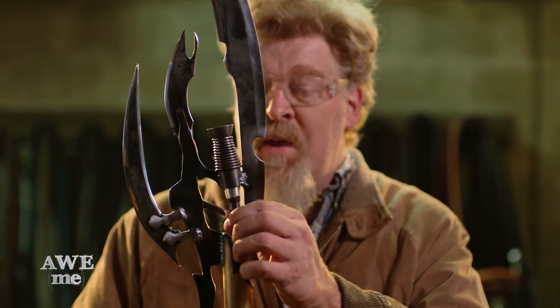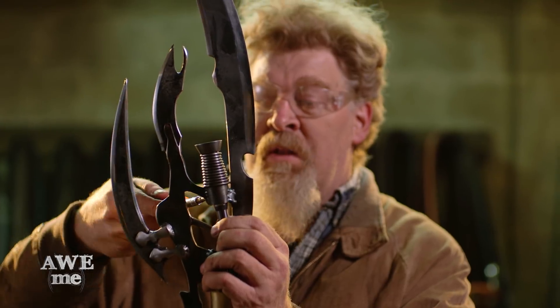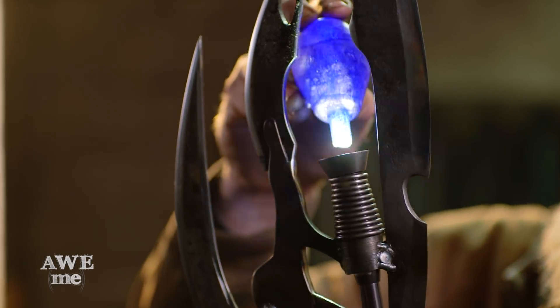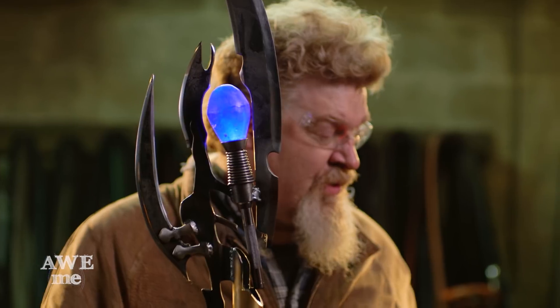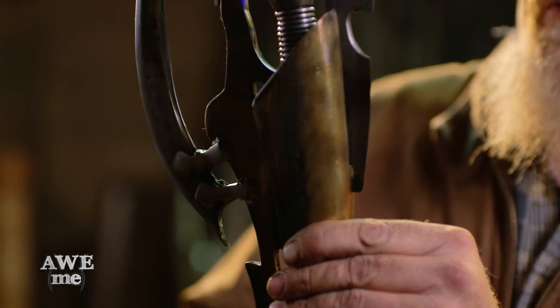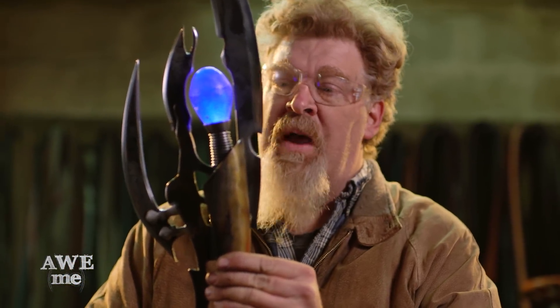This is our hacked flashlight. It's got the really hot LED. We're going to drop it down in the pipe. It'll slide up into its mount. There's a lock on the back side that will be covered by the plate. It rotates to turn on. Set our crystal in place. This will be set in silicone. And then this is the first of four top covers. There are four or five bottom covers that go in place as well. They'll get tack welded, and then they'll be brassed so that everything's matched. But before we do that, we'll make sure that we have all the finishes the way we want them.